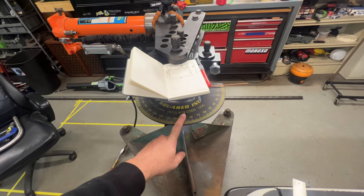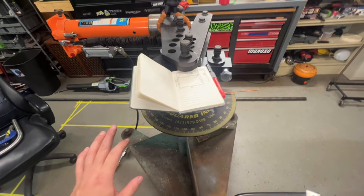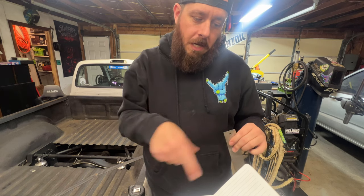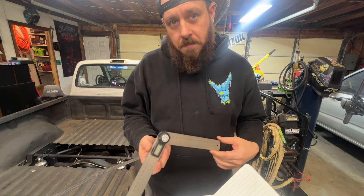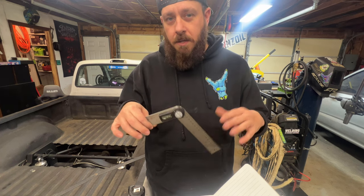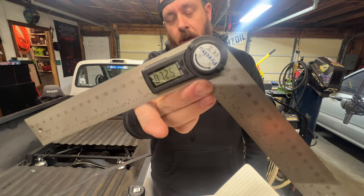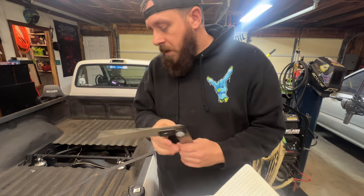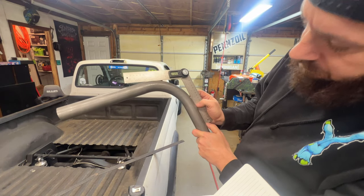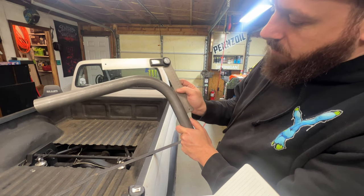This is usually a ballpark thing for me, so I do it a little different for knowing specifically where I'm at. So the way I do my bend angles on these, instead of the dial indicator or whatever you want to call it that comes with them, I use a digital protractor. Laid out flat on a straight edge, flat table, whatever, zero. I pre-bend it to 72.5, which is the bend I know I want. The only problem I've had with one this size, it barely gets enough flat before you can really measure the angle, and it gets kind of obnoxious to hold.